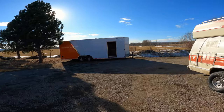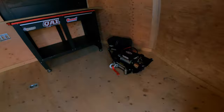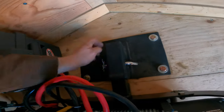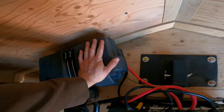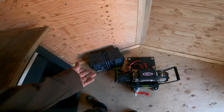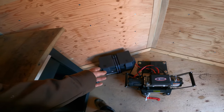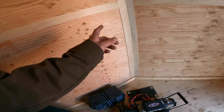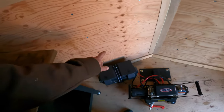We've wrapped up the enclosed trailer winch job. Here's the finished product — the electric winch is mounted to the floor with my plate on my little receiver hitch. You just pull that pin out, slide it out, and take it wherever you want. Of course you've got to disconnect your battery connections first, but that's fairly easy. To power the winch I threw in a 900 cranking amp Group 31 commercial battery, and I have it set up so it can charge while I'm driving.